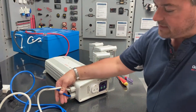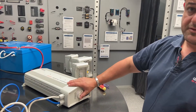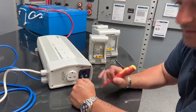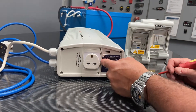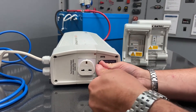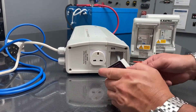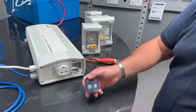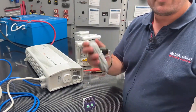With our KISS-A unit you've got your main connection - AC input and AC output - for connection to the rest of your system. You can also use the socket on the front of the unit just to plug in if you wish. Over to the right side of the unit we've got a USB socket, which is for recharging your mobile phone but we also use it for firmware upgrades. There's also a multi-function panel on the front of the unit. If we unscrew it, the panel pops out and you can mount the panel remotely from the inverter itself. The inverter is supplied with a remote panel cable of seven and a half meters.